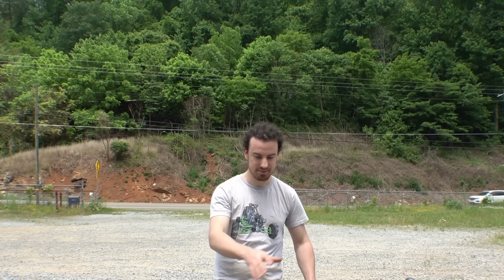How fast do you think you're going? I have no idea. I mean, it had to be 35? Yeah, 35, 40 at least by the time you got to here. And this is a scary thing about these engines. I can hear that that's like half throttle. Yeah. That's half RPM. Yeah. So the clutches seem to be working really well. Yeah, now that I adjusted the belt tension, it's engaging a lot faster. It's not as hesitant. Yeah, there's not a big belt lag. Yeah, exactly.